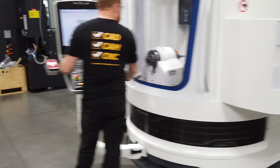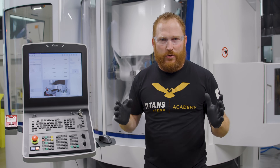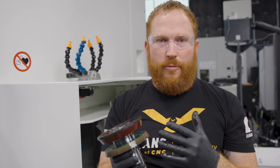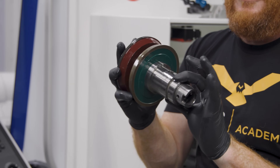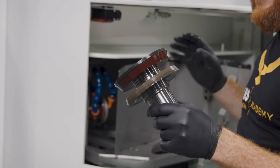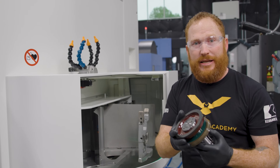This machine is also equipped with a four-pocket tool changer that's going to give us a maximum of 12 wheels to do all sorts of different contours and features on tools. This is our automatic tool changer — I'm going to open it up so you guys can take a look. This is known as a wheel pack. I have two different wheels on here used for different operations. These wheel packs can hold up to three wheels each, so with four pockets I can hold up to 12 wheels depending on the application.